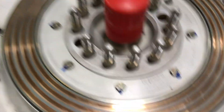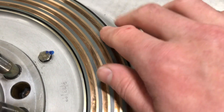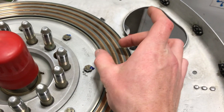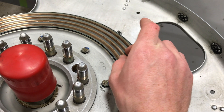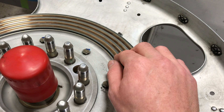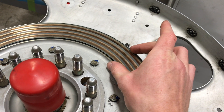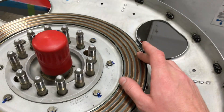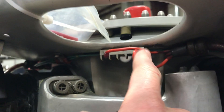This is what we call the slip ring. You can see kind of copper rings around here — this is where the brush block mates up against. There are eight, or maybe 16 brushes total on the Saab, on a bracket mounted on the PGB, with carbon brushes that rub along these rings. That's where the power gets transferred through. These rings are all hooked up to these leads — some of these wires — and they in turn power the electric de-ice boots.